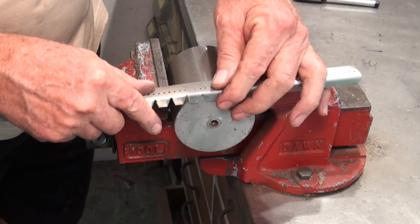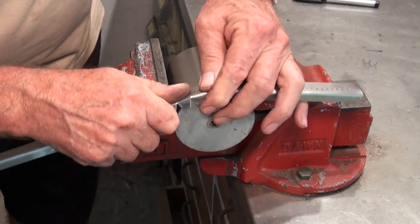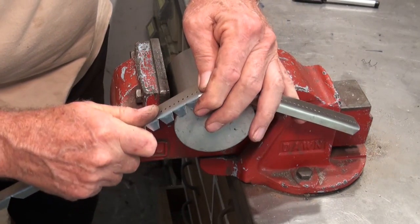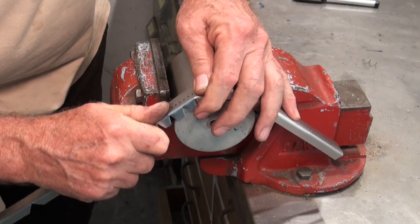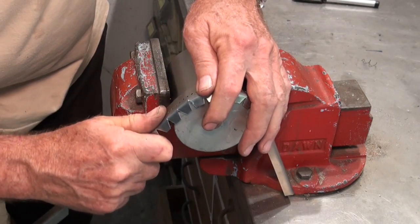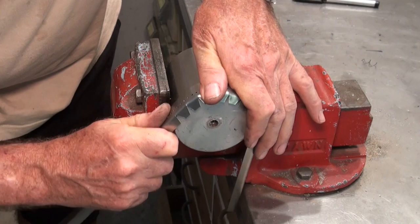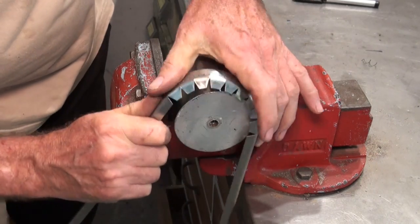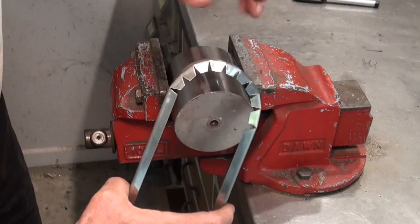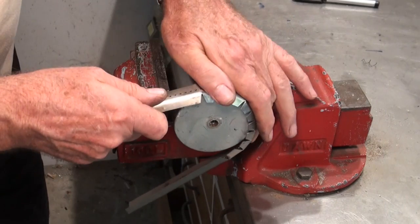from a tangent point and just try and stretch it. It's naturally going to want to bend where the notches are, so you don't really get a curve, you get a series of straight connected sections, but it'll be approximate. And it'll smooth out as it all gets welded down, so not too worried about it. So that's starting to get towards the shape that you want, and when this is all spot welded down, I can correct anything that doesn't look right.